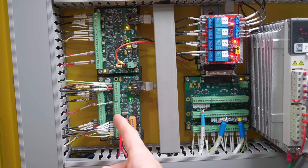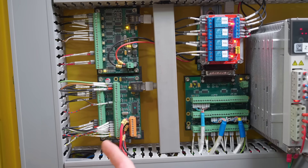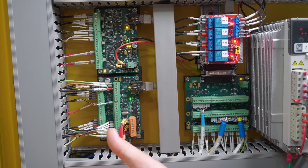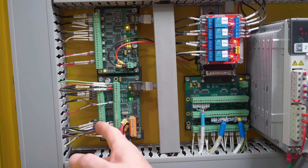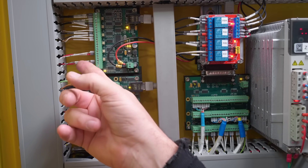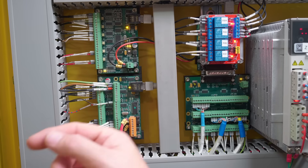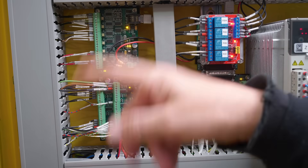I/O is being done off this Mesa 7i84 card. Each bank has eight outputs and 16 inputs — 16 outputs should be enough for this machine. Unfortunately you have to apply a certain field power to each bank. Because I've got 5-volt Hall sensors for my home position sensors and the tool changer, I've had to put one bank onto 5 volts, so I only get 5-volt outputs from it. The second bank is on 24 volts but that only leaves me eight 24-volt outputs, which wasn't enough. By using a couple of unused axis enables from my six-axis card I got a couple of extra 24-volt outputs, and once those ran out I used 5-volt outputs to trigger relays to switch 24 volts — but I've run out of those as well.